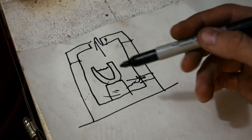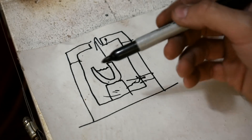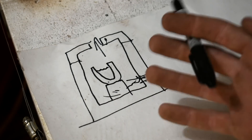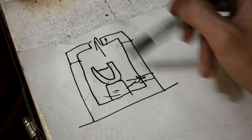This has a couple of great features. There is a ridiculous amount of airflow — this big hole in the top is actually very large, like a four inch diameter circle, and I'm forcing air in the bottom, so it's belching flames out the top. A lot of airflow means I can burn a lot of fuel, and that's partly why this furnace is capable of getting just insanely hot in very short order. However, it's a little bit aggressive — it'll go from cold to molten iron in under 30 minutes. If I put anything I don't want to melt in there, it's going to melt.